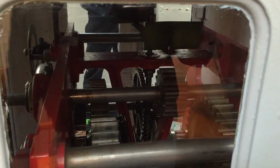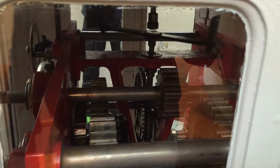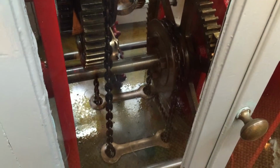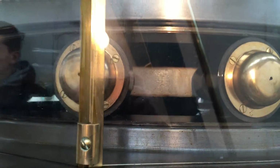Now the importance here is that every lighthouse has what's called its own character, and that was the flashing of the light itself. Here at Kinnaird Head, the old light was a white flash once every 15 seconds. A full revolution of the lens took 30 seconds. A ship out at sea sees a light flash, and they'll time it to see the next flash. They'll then have their chart on board, and that sequence tells them the light they've just seen was the one at Fraserburgh, at Kinnaird Head. Every lighthouse has a different character, the timing of the flash, so he knows where he is.